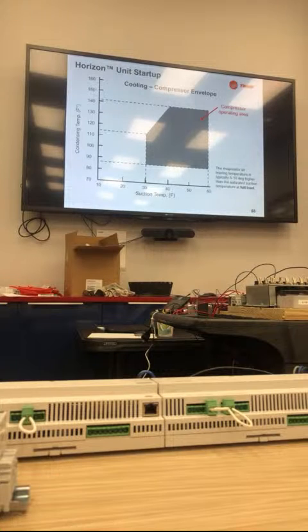What was your issue with them? The liquid line transducers leaking. The O-ring, or was it the body, like what goes up in the transducer itself? I have one with the O-ring leaking. Yeah, we've been working with the supplier on getting one that goes directly onto the fitting instead of having that piece that goes in the middle. We just approved it last week and they're making them now. We should be getting them in house in the next 2-3 weeks, and then we'll be using them.